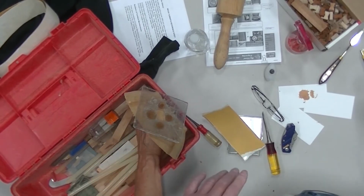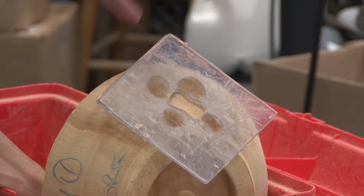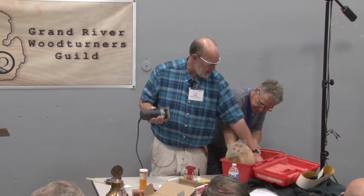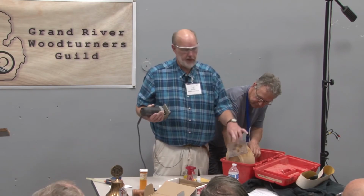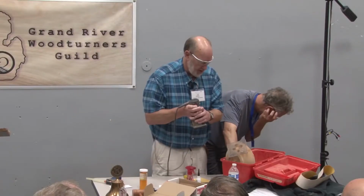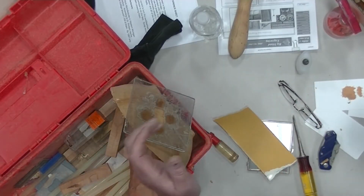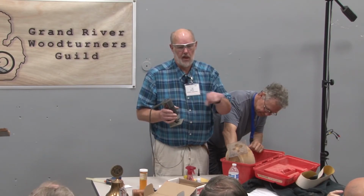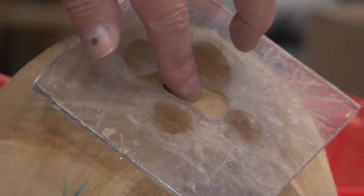Now the bushing just sets the distance in from the shape you've got cut. And you'll notice, if you looked at those pieces that I passed around, that when you cut those on a table saw, you end up with a sharp point on the end. When you get done cutting this hole, you have round corners. And I'll talk about that in just a minute, but I'm going to cut the hole here. Before I start, what I like to do is start in the center and then work my way out. Because if you try to get close to the edge, you might end up with a bushing on top of that, and then you've just screwed up your whole deal and you got to start over.